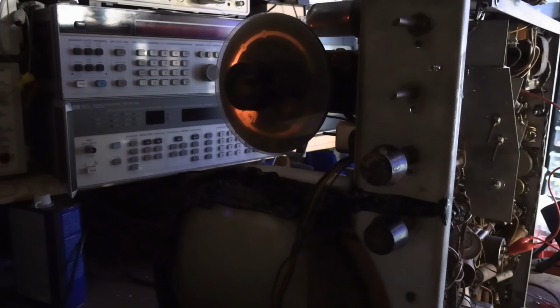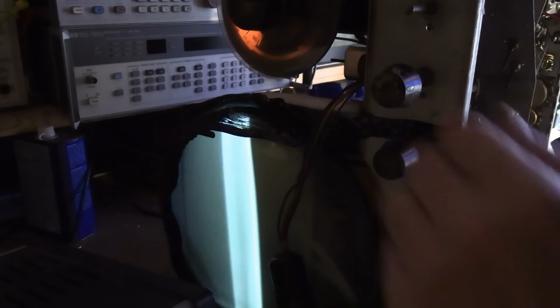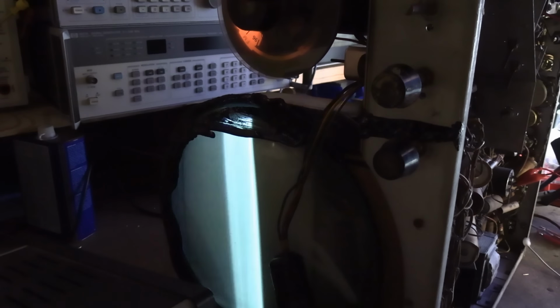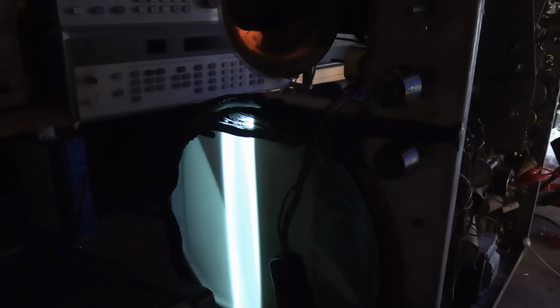So let's keep going. I got about 95 volts in. This is roundabout where things start happening. Couldn't have planned that better. We have deflection, we have illumination. Fantastic. B plus has been rock stable as I've been slowly increasing this. It's just been going up, settling down, going up, settling down. Going up a little higher. Alright, we got about 110-ish going into the set now.